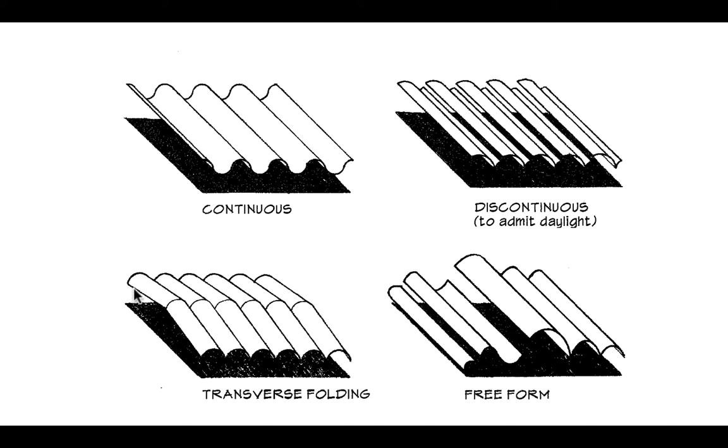Like folded plates, we can adjust the shape longitudinally to get something a little bit more efficient. We can get a little bit of what we call a beam arch — a beam that is curved away from the tensile region so that most of the beam ends up in compression.